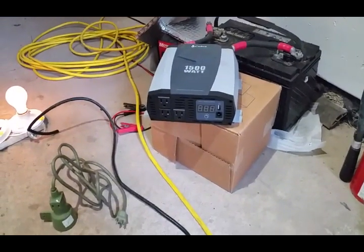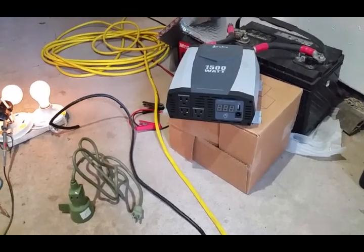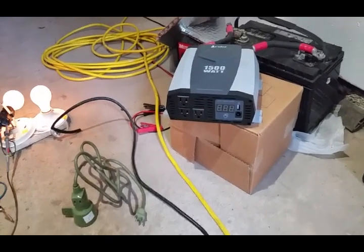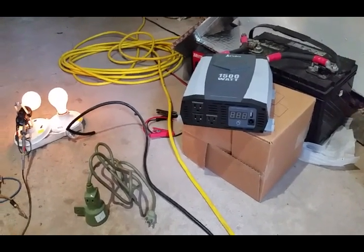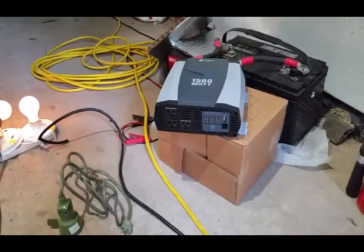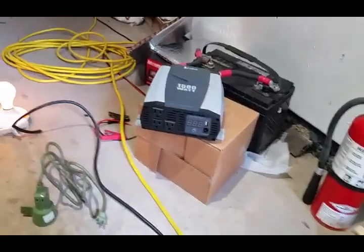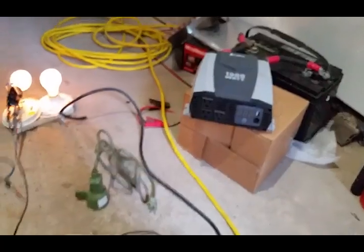To contrast that and give it some clarity, I have a 1500 watt cheap inverter right over here. It's a high frequency inverter — a modified sine wave apparently, though I don't think it's much of a modified sine wave at all. It's more like a chopped-up square wave. It says 1500 watt on it, but you can do 1500 watts with something like a tea kettle. If you put something with a switching power supply or a 300 watt motor on it, because of the surge current, this thing will just shut off and start beeping. I can't stand these high frequency inverters — they're cheap, and that's about it. They're fine if all you're going to do is run a laptop, a tea kettle, and a cell phone on a boat or RV. But if you want to power more substantial things like a pressure washer, an air conditioner, or a microwave, you're going to need pure sine wave.